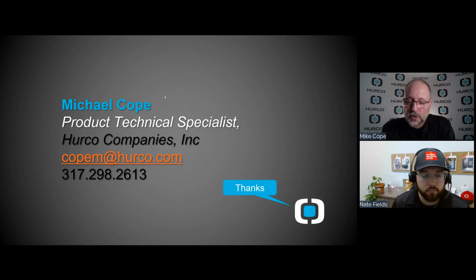Going from 3-axis or 5-sided to simultaneous, that's going to take a little longer because now nothing on the machine side, but now you have to learn the new tool paths in the cam system. If you're programming simultaneous, you're going to have to learn how to use each one of those, how to apply them, what kind of constraints for the tool and things like that.